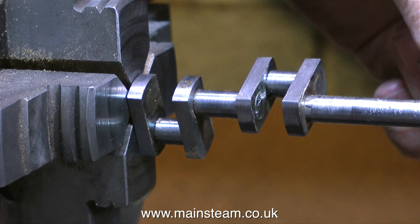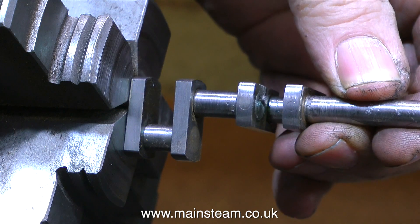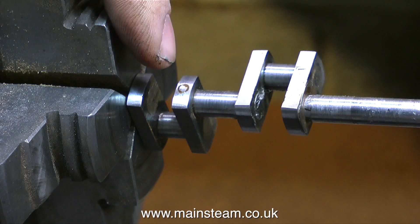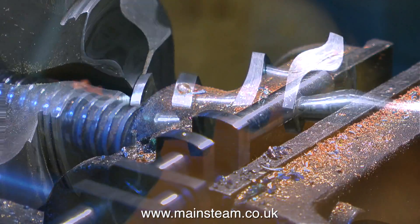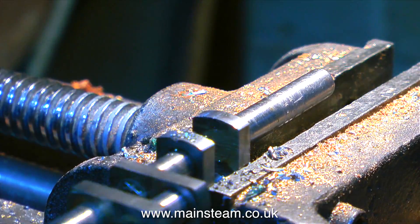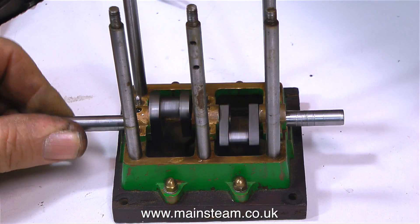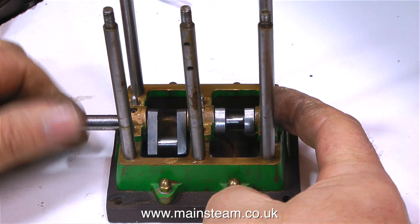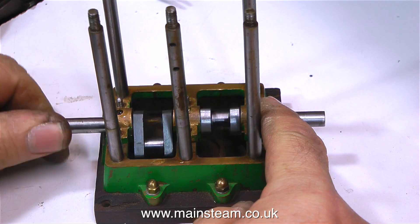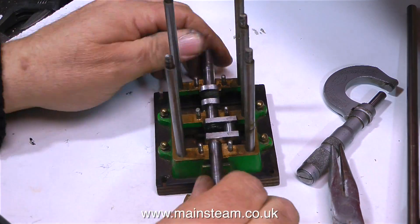When I put the crankshaft back in the lathe, I notice it's still not right. The part I've fixed is, but the next part is also loose — I didn't notice this because everything was really moving. You can see the oil ring around the pin. This is a deja vu; I'm going to try and fix the second one. Actually, I've already decided to scrap this crankshaft. When I checked it in the lathe with the dial test indicator, it was bent in so many different places. So it's really scrap.